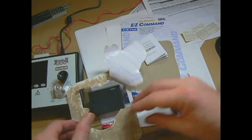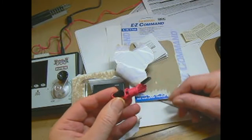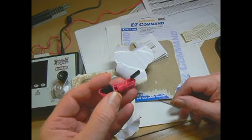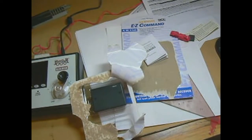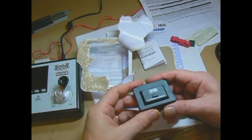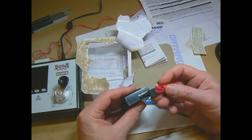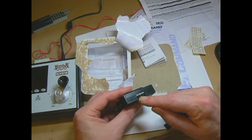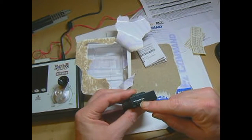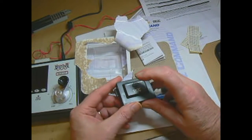Here's the power cable - it's a three-prong cable that connects directly to the power strip on the Bachmann controller. The unit has room for three plugs on the outside: a DCC power input where you get power from the track or neighboring unit, a connection to the turnout via the green cables, and a power output where you can chain these things together. It's also got a switch on top which you use to set the unit into programming mode.